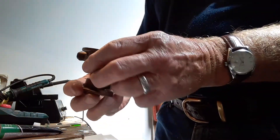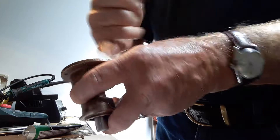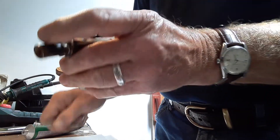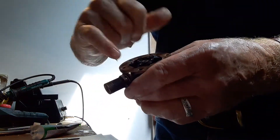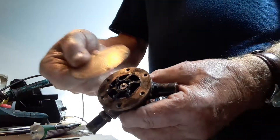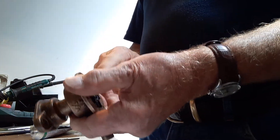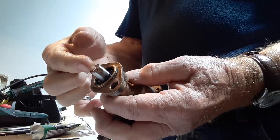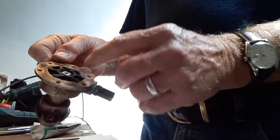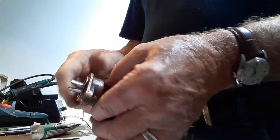So that's the pump done. I'm going to put a little bit more grease in there and settle that impeller down — loads of grease in there. The temptation now would be to put the gasket on and screw the top on, but I'm not going to do that. Because if I did, when I come to put this back on the engine, I wouldn't be able to turn the impeller to locate that slot with the lug in the engine — I'd have to hand-crank the engine to line those up. So I'm going to leave the cover off, put the pump back on the boat, turn the impeller to engage that slot with the lug in the engine, and then put the cover back on.